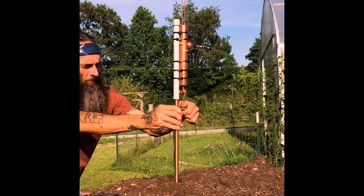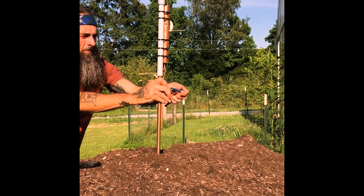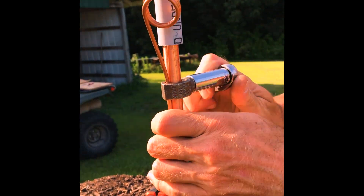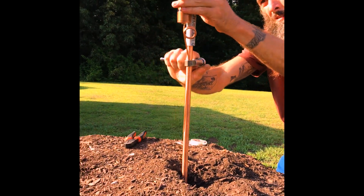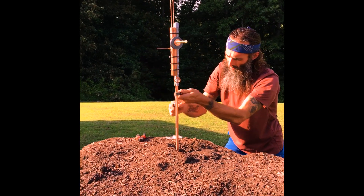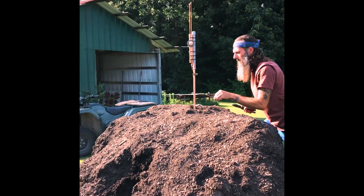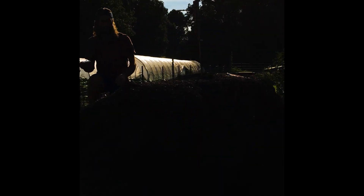That hardware will attach the 8 gauge wire coming out of the bottom of the antenna body directly to the ground rod. Notice that the body of the antenna is insulated from the rod and only the wire is directly connected, very tightly. These connection pieces are available where the ground rods are sold. Just make sure if you get a 5/8 ground rod that you get a 5/8 wire clamp connector. Cut off the extra wire.